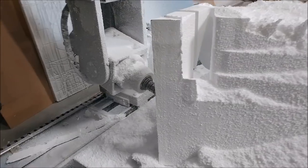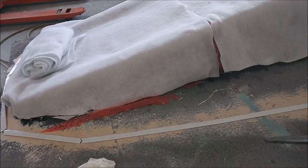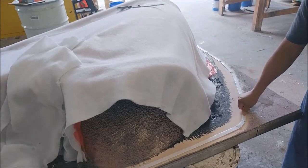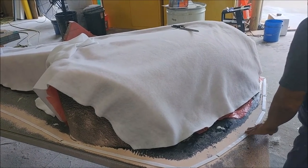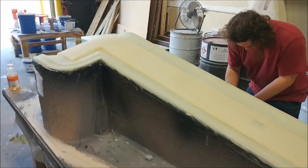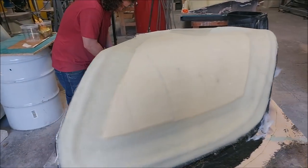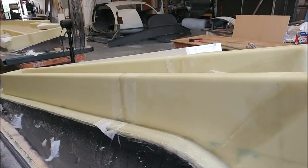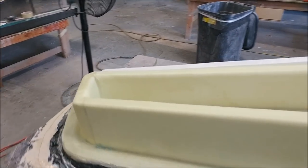Meanwhile, Chris and Roberto are in on Thursday finishing up the heavy layup on the outside winglet skin mold. They've already laid everything up and are just finishing off with the breather fabric getting ready to bag it. The other one was done the previous day on Wednesday — Devon is cleaning up the residual tacky tape and the guys quickly threw the bracing on that one Thursday night.